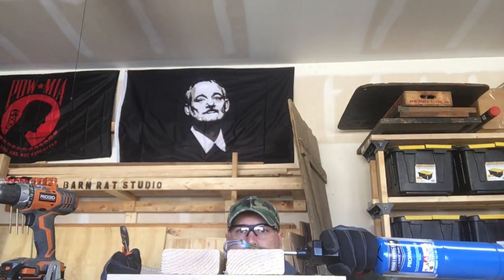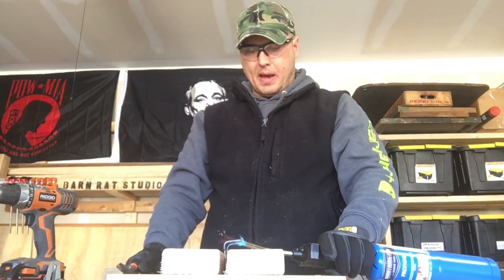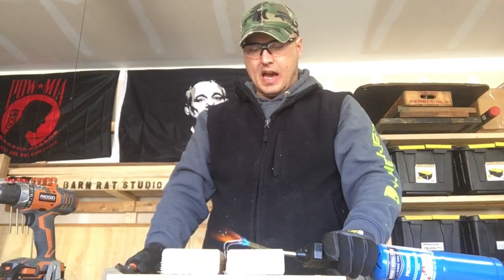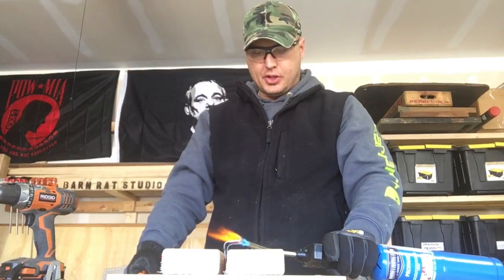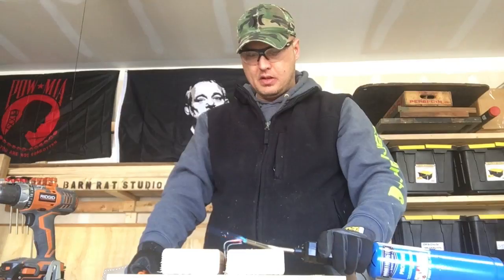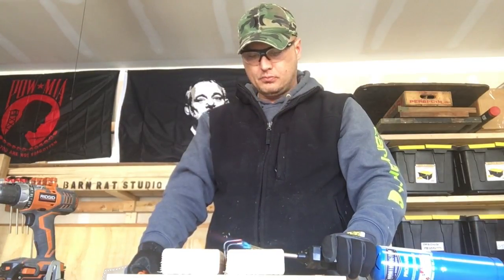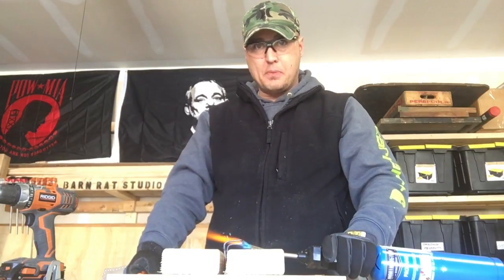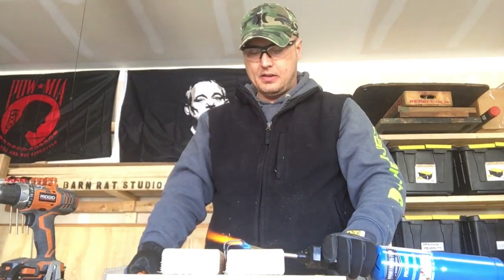Now, once you get that bend, we're going to give it one more 90-degree bend. Again, heating up the bar, using the tip of the flame coming out of the torch. Get that nice and red. Heat up the other side real good. I know, this is the fun part, right? It's like watching paint dry. We've all done it, but gotta get here.